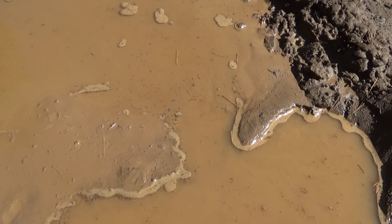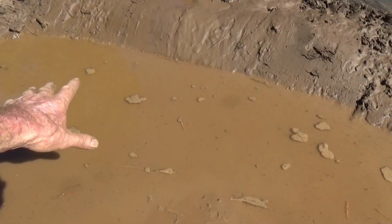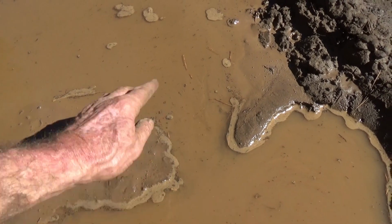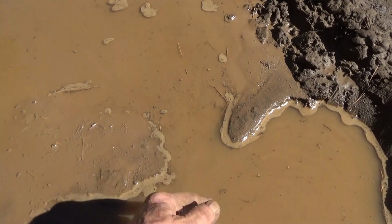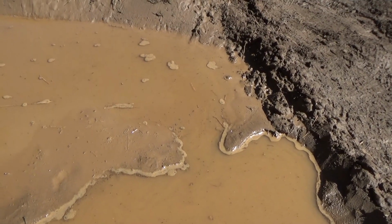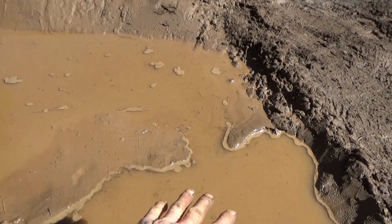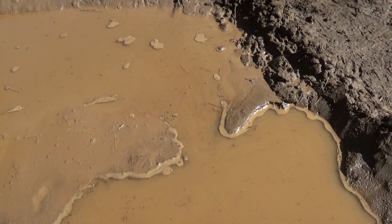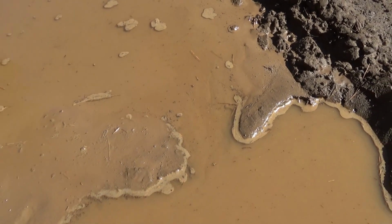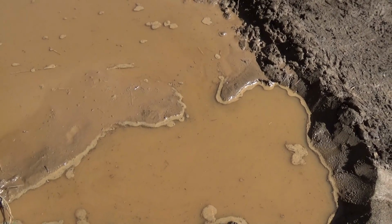But then I have this hole and it's in the coarse sand. We have time and the slime settles to the bottom here, and see how the solution, the fairly clean stuff, kind of works its way over here and then gets filtered down into the bed fairly quickly. It seems to work pretty darn well by letting it settle and then essentially letting it auto-skim the surface. You can see a little bit of movement around here just from the wind, but on the whole, there's a slight current coming this direction. See it in there? And that's because this is settling and filtering, and this is clear enough that it's not really plugging that up.